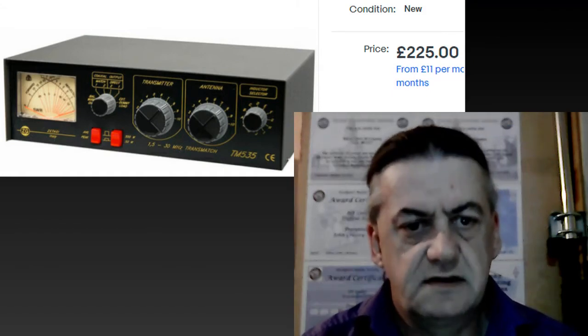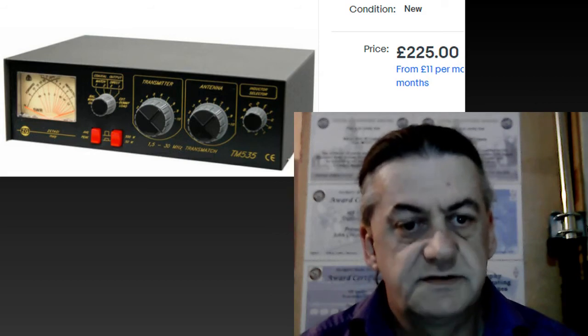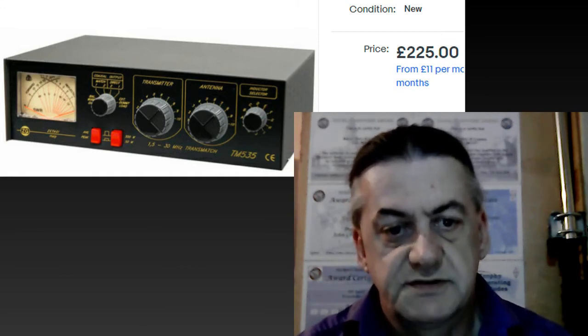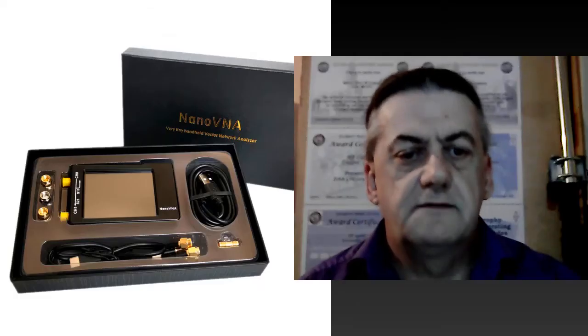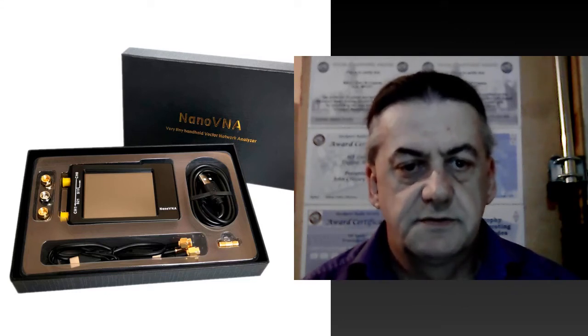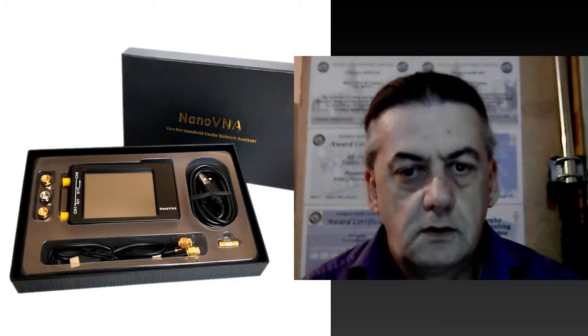As this radio does not contain a built-in tuner, you will also need to purchase one. I recommend one with an SWR display, possibly a cross needle like the one shown. If you have an antenna that is tunable, you may find it easier to use something like the Nano VNA, or possibly a dip meter, or something along those lines. If you wish to use the digital modes — FT8, FT4, WSJT-X — these will access the radio with CAT control via USB.